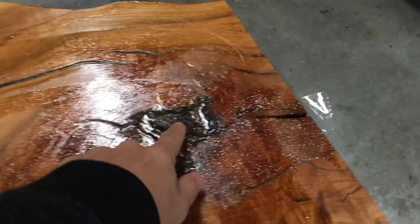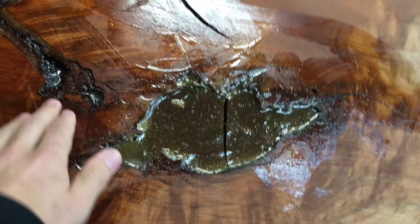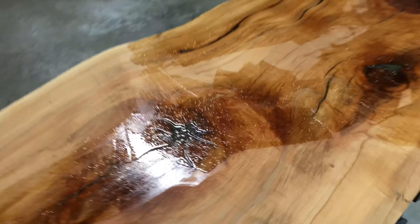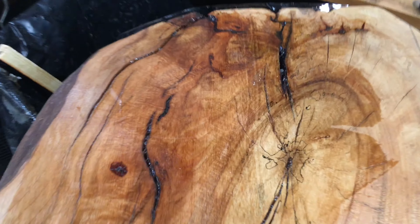The next day you can see it's dried up. It did sink a little bit in some spots, so I'll go back and add a second layer. One of the locations got a crack, so we'll just refill that and re-sand it. All in all it's pretty good for the first fill — definitely going to need to refill in some spots and might add a little more copper flake to give some spots a brighter reflection. You can see the metal copper flakes and it's coming out pretty good; I'll let it dry and come back for a second fill, then re-sand and maybe re-stain.